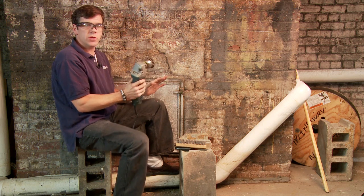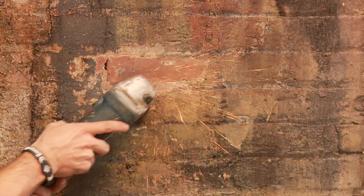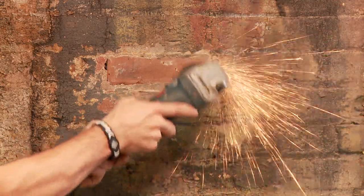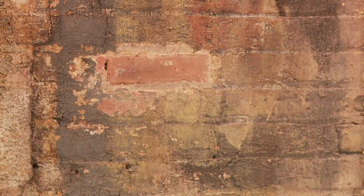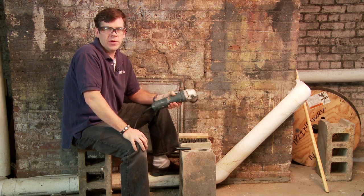Last, what we're going to do is the cup brush. When you use this, don't push hard. Brick is soft — this will eat right into the brick. You don't want to leave divot marks. What you want to do is just lightly float it over wherever you see something that looks like it's going to come off. That's how you remove paint from a brick or concrete wall for indoor painting. Thanks for watching. I'm Chris Boss.